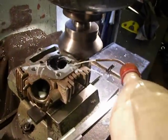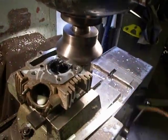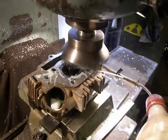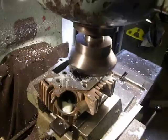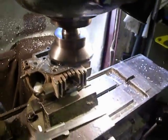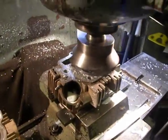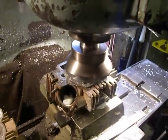A little bit full on. This milling kit is made by Sandvik. For aluminum, you need good cooling or oiling — the best is kerosene for aluminum. You can use diesel too, for proper aluminum.